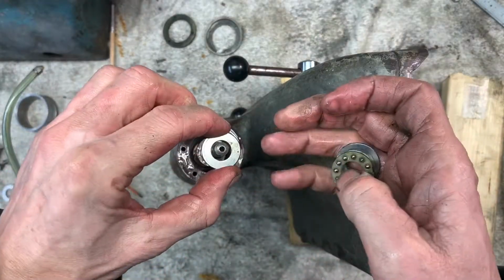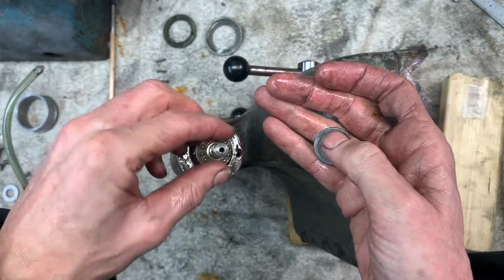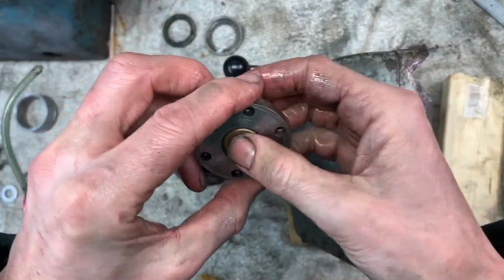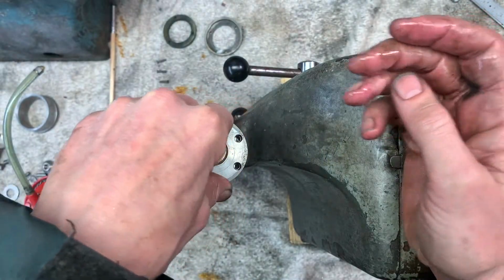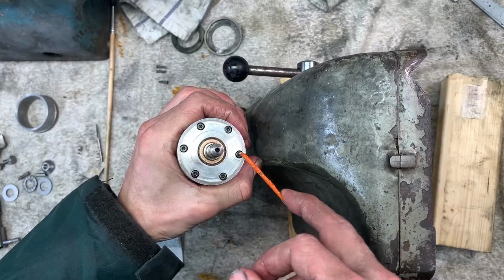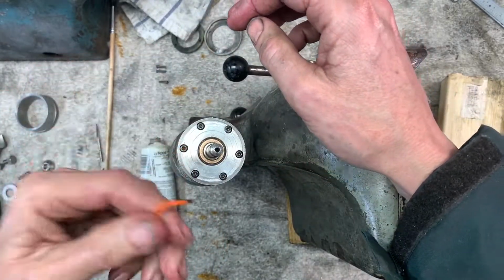Okay. There's a little nick in that one, but I don't think it relates to anything inside the unit. Put the end cap on with the oilite bushing in it. Okay, so pop my cap heads in, and that end plate, that thrust plate now, back on.